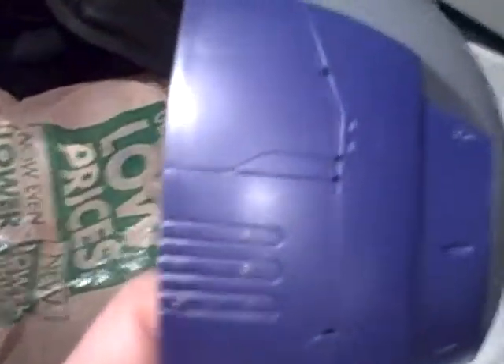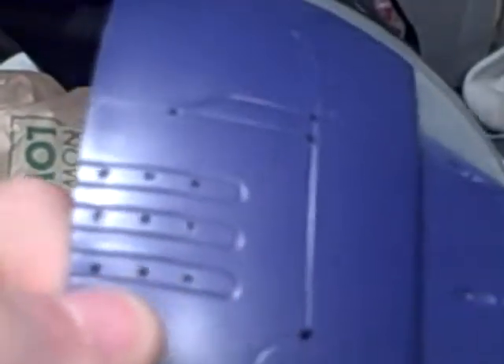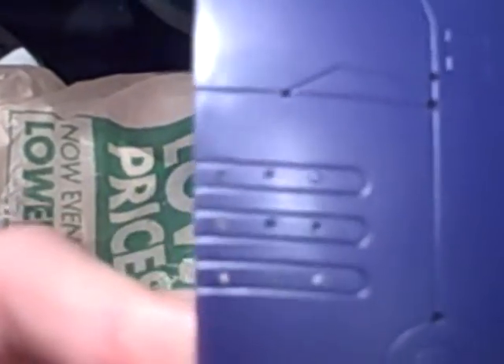Good morning — this is the day after. Here's this side fully drilled. There are four holes there, then seven holes coming down here, then three holes there, and three holes on this side. These nine holes were done with the template — I printed it on thicker cardstock, taped it down with duct tape, held the bend in place with my fingers to give it a slight curve. They didn't come out perfectly even but they're good.